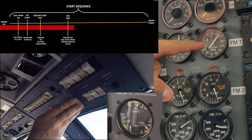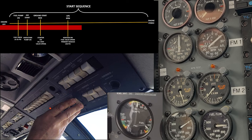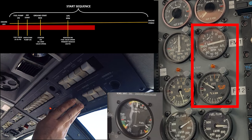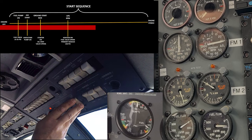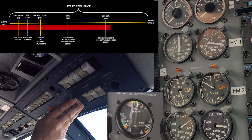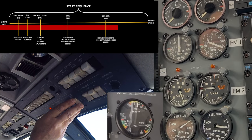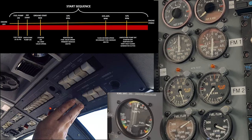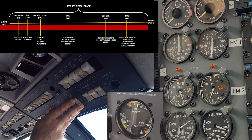You will notice to the left of my hand is an orange light — this is an indication that the igniters are energized. Now our primary focus is on the RPM and ITT gauges. We're looking for two things: a steady increase of RPMs, and ensuring the ITT temps remain below 1149 degrees Celsius. If RPM stops increasing or temps indicate that we will exceed red line, we immediately put the condition lever to engine off. At 35 to 40 percent RPM, the secondary fuel nozzles open and ITT temps should have peaked and will begin to decrease. Above 50 percent RPM the engine is now self-sustained. The starter will disengage and switch in the generator, and the igniters and unfeathering pump will turn off. The start sequence is now complete. The engine stabilizes at 70 percent RPM and ITT temps are 650 degrees Celsius.